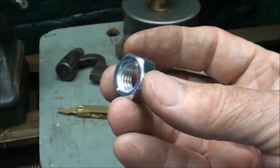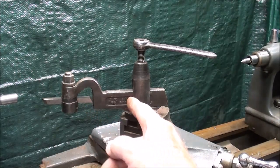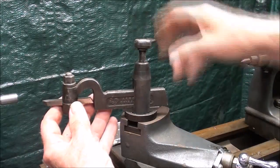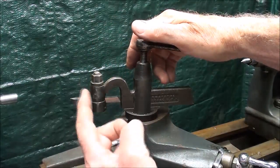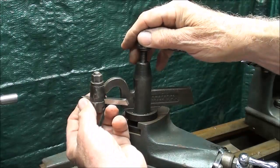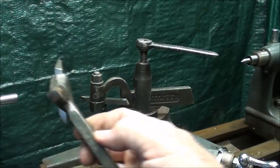What is wrong with this picture? We've got way too much hanging out here, so we're lacking rigidity. Never do that with any kind of tool holder. So we're going to choke it back up like that, and then we have way too much tool hanging out here. You can cut your tool off if you want it to go straight in, but I'm just going to cock it a little bit so it clears — that's a handy position anyway because in effect we've got a bent tool holder, similar if not identical to the gooseneck type.